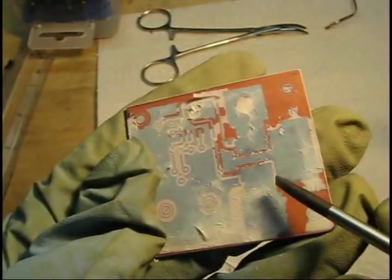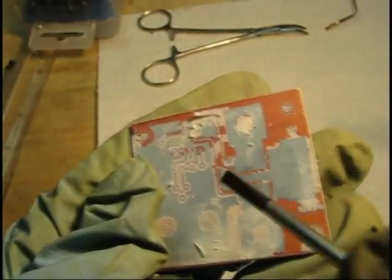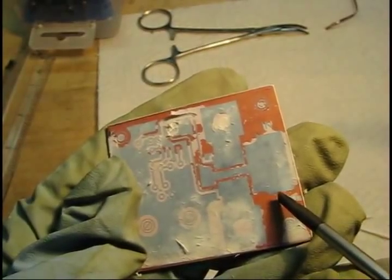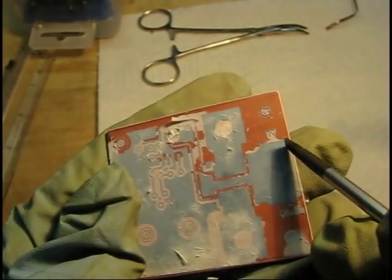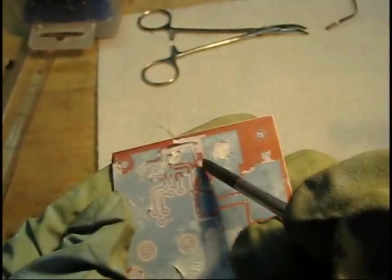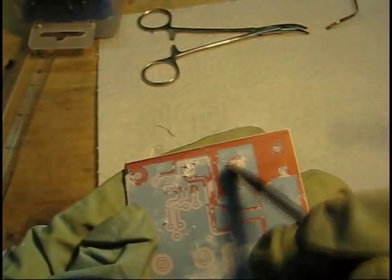The paper seems to peel away, but this gloss coating that the Staples paper has is pretty resilient to the etch — perhaps it's something to do with the chemistry between ferric chloride or cupric chloride. You can also use a paper towel with a pair of plastic tweezers and rub the gloss coating off during the etch. If you just agitate it, it won't come off by itself, but all you really need to do is clear up the sections that aren't supposed to have copper in them. This is actually a current sensor board that uses SMD parts.